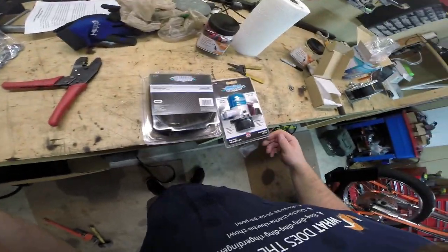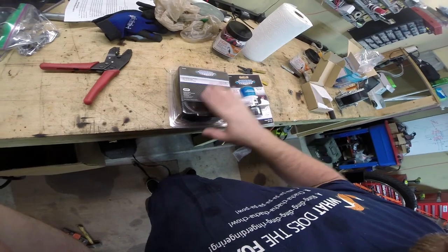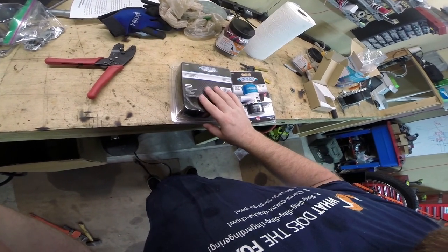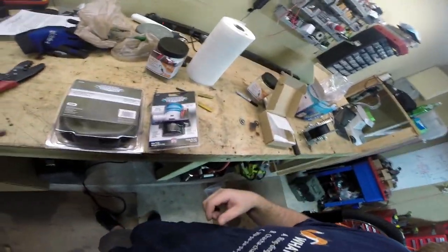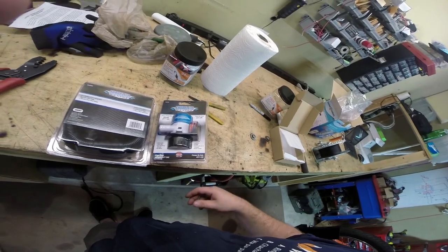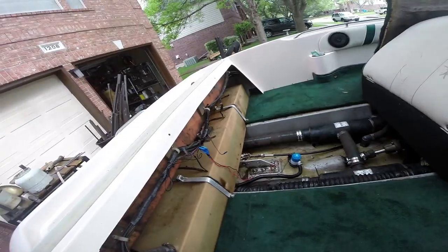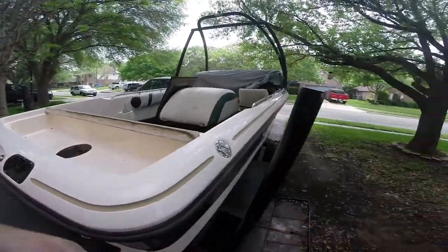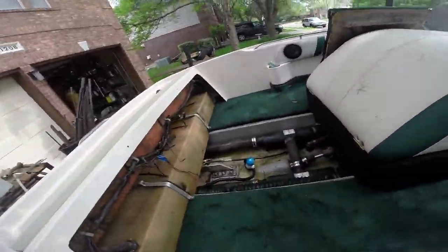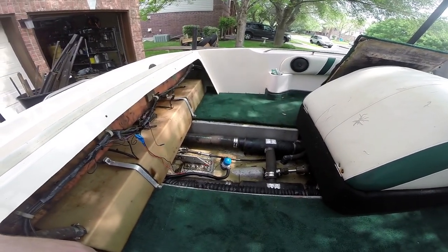Next, we're going to install a secondary bilge pump in the back of the boat. It's actually pre-wired with switches, but it looks like somebody removed it. I got a five-foot piece of hose to run the water out and a little bilge pump that floats in the water — we're going to put it in the back behind the engine where all that water collects. There's our pump installed. We ran the tube all the way up to a vent port in the back. It sucked out all the water it could, but once that black part isn't submerged it can't pull any more out. Still better than nothing.